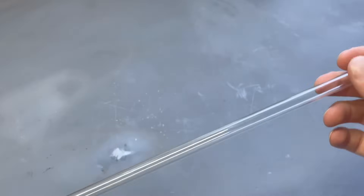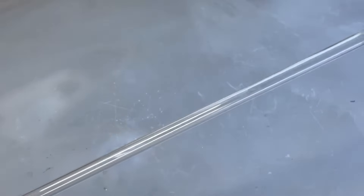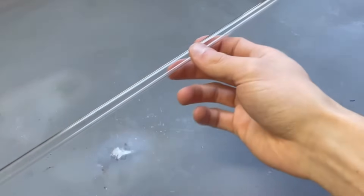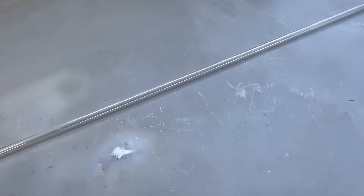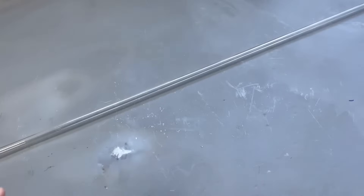We're going to start off with basic tubing. Now I'm not an expert in glassblowing, so everything you see in this video take with a grain of salt, but I decided the best way to learn is to also try to teach some of the basic techniques I've picked up through practice with glass tubes. Glass normally comes in long tubes like this. These tubes are great because you get a lot and it's quite cheap, but it's hard to work with. You're going to want something shorter — I like to cut this length of about four feet in half so it's easier to work with.